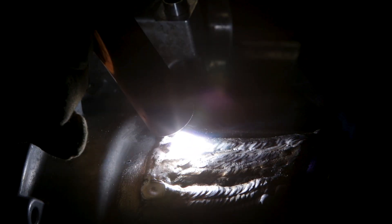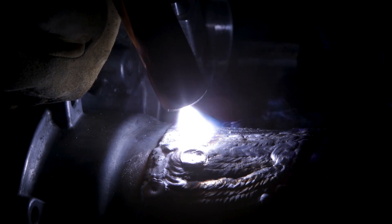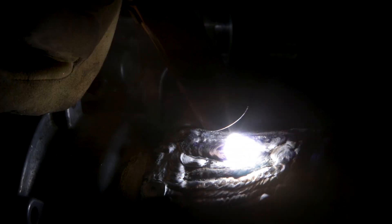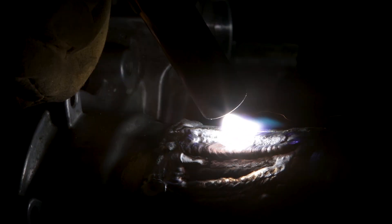If you have ever used a spool gun on aluminum before and been frustrated, this is not that process. This is a very controlled, very precise process — it really lets you control the amount of metal going out there and where it's going. The slider set up on that HTP welder is really impressive. If you're coming to the edge and it's starting to get a little too hot and out of control, you can just back off the heat by running the slider down. It is almost as controllable as TIG using a foot pedal. The only downside is the potential brain damage from listening to that noise for hours on end — definitely wear earplugs — but it's worth it for the end result.